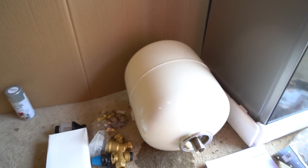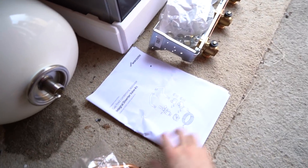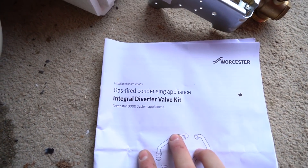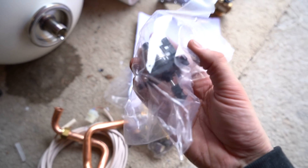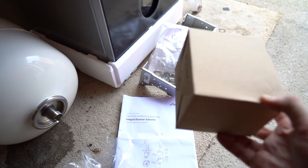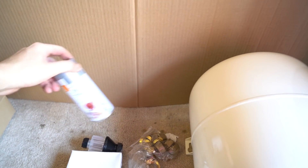Welcome back to the first video in a long long time. I'm going to be fitting the Worcester Bosch 8000 Style in black. I've really specced up this system to make it as best we can. I'm going to fit for the first time this integral diverter valve kit, and along with a little bit of wiring we can turn this into the most efficient system we can. That means we won't be swapping these after a few years - everything's going to be under the warranty of the Bosch boiler, which will be a massive bonus.